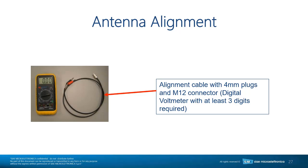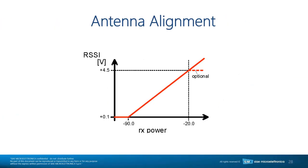You can find the direction of the interfering signal by taking the voltmeter and holding it to the metal pole on which the antenna is mounted, then moving the voltmeter around the pole. You'll find a spot where the pole provides shielding and you get the accurate voltage. There are also relatively good voltmeters on Amazon in the $25-$30 range that don't have these issues because they're copies of the actual $800 Fluke designs and contain shielding. The voltage you see is proportional to the received power — you are aligning for maximum voltage.